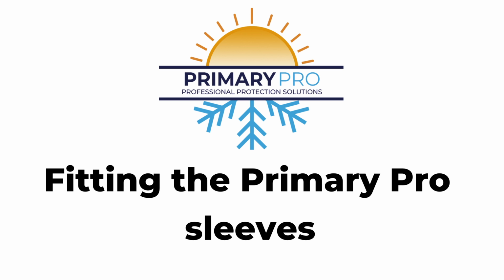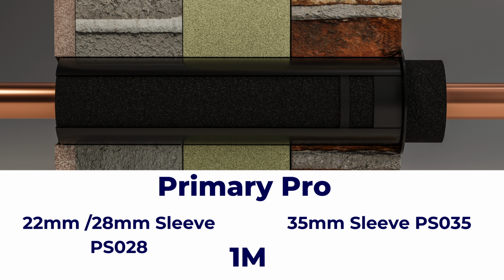We're going to go through the new Primary Pro sleeve. Now the Primary Pro sleeve comes in two sizes. The 22-28 sleeve, which is a PS028. That's primarily for the 28mm insulated pipework, and it does fit our 22mm Primary Pro, that's 22mm by 25, but you will have to shave it off.